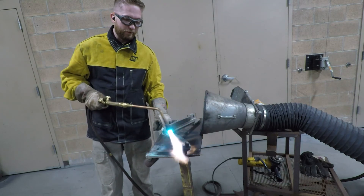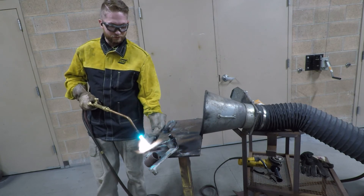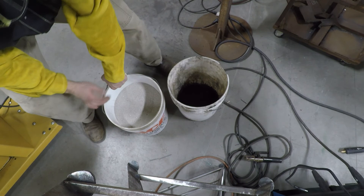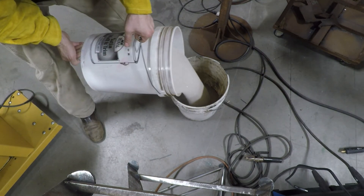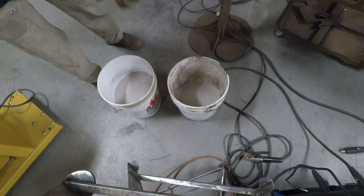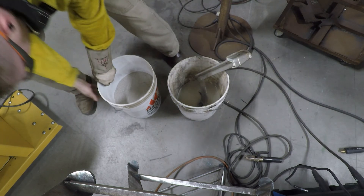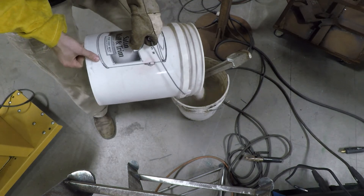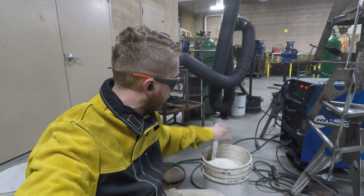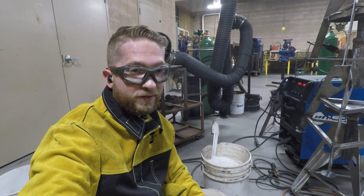I'm going to get this warmed up one last time and then drench it in the sand to insulate it from cooling too fast. Maybe it's overkill for this nickel, but it welded really well. You can kind of see the beads as I'm grinding away. It's not just the welded area — I want the whole thing to cool down nice and slow, so I'm warming up more of it than just where I welded. Let's get a little bit of sand down in there, get my glove back on, just like that, and then cover the rest of it.